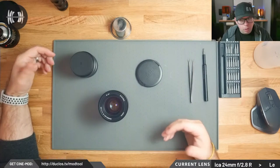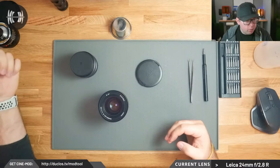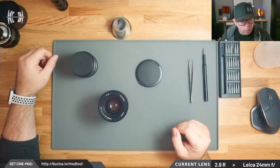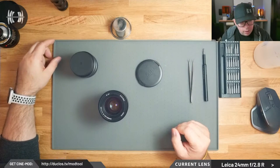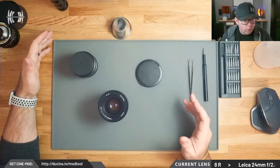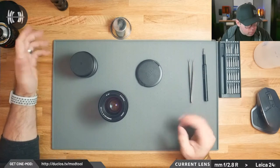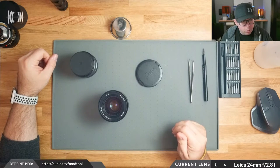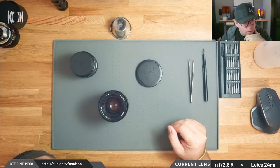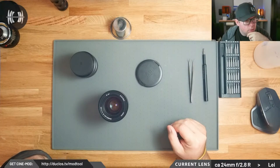As far as mitigating dust, our building is a giant filter. We have three separate industrial filters for the whole building, and then the service department specifically has additional filters. There are so many things that we do to reduce dust as much as possible. Humidity is a great tool. Everyone always thinks you have to have the driest possible environment, but no, you actually want some humidity because that combats static electricity. So there's a lot of little things that we do. The wipes that we use are all Kimtech Kimwipes, so they're very low lint. I could go on all day. Our air hoses are ionized and filtered completely redundantly over and over. So yeah, there's tons of stuff.